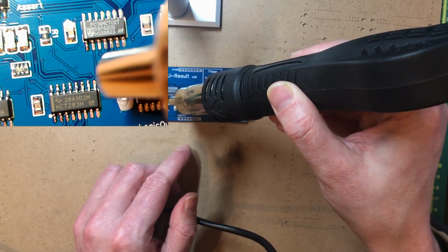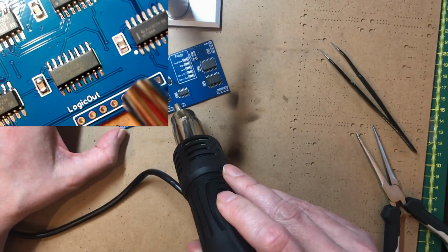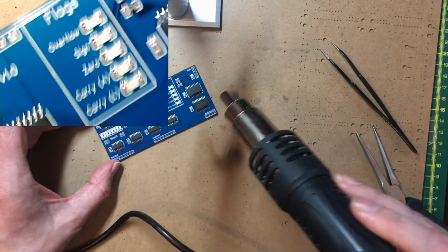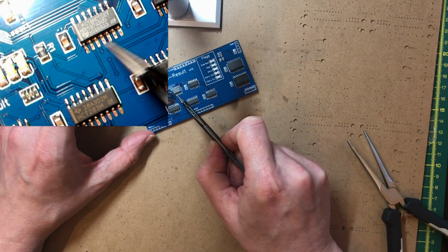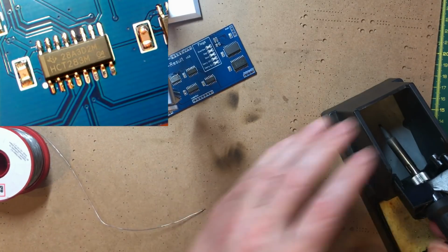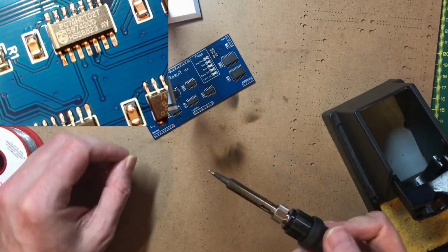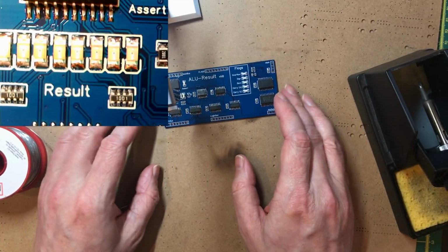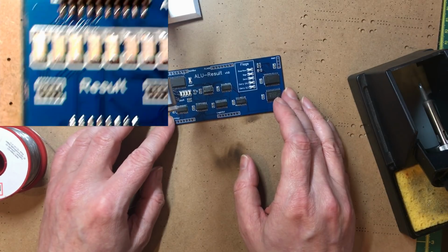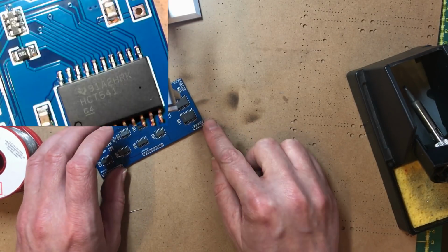Okay, I'm going to check the video on there, because that doesn't feel like there's much solder paste on the pads. A few of the pins on this chip didn't look like they flowed. Fortunately, we have a very simple solution to that problem. And to be honest, I like the way that solder paste behaved in most places, so I'm more inclined to think that was down to bad solder paste placement with the stencil. It was bending a little bit. This new paste has handled the resistor arrays really well. Okay, let's get the pins on.